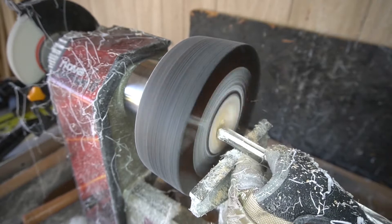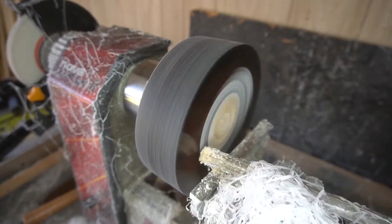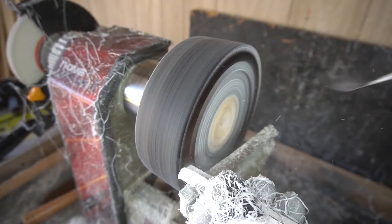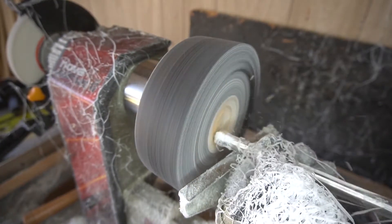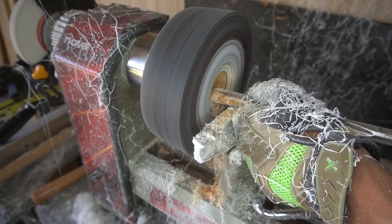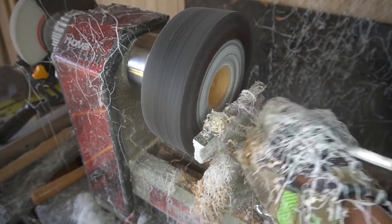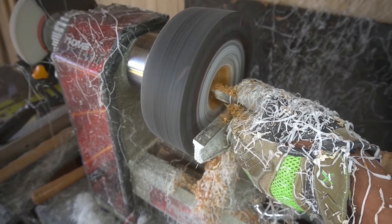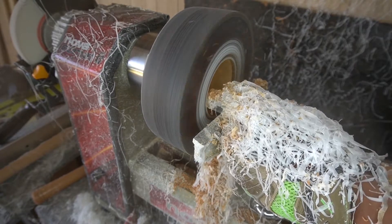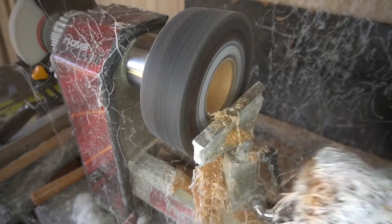On the lathe while I'm gouging it out, you can see some wobble here, but it really isn't a problem until a little bit later in the project. Once we got that all down, I'm just gouging it out, trying to make everything nice and even. I probably should have taken more material off — I don't know if that's just the unevenness of the blank or the fact that I'm pushing the weight limit on my midi lathe. This isn't a giant lathe, it's basically a middle-of-the-road type of lathe. This is probably the max amount of material I can put on it without getting that crazy wobble. If you've been watching my channel, you know I've done some larger projects where the thing wobbled all over the workbench, but that was mostly due to the unevenness of the material.